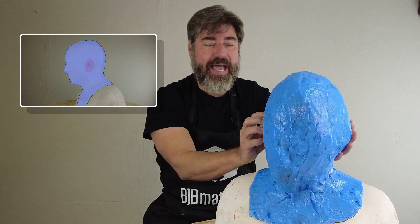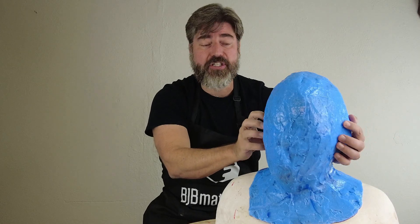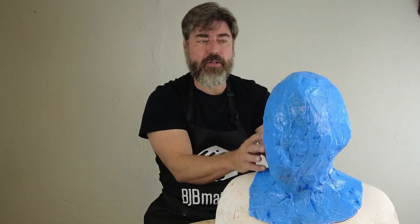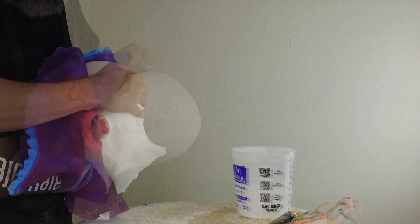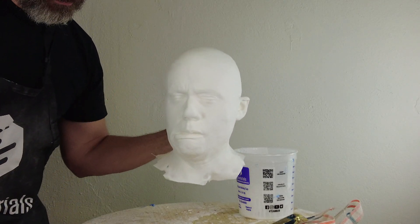The reason for the soft silicone around the ears is that ears have really complicated undercuts. You don't want too much drag or resistance on those ears or they'll snap and break when you demold. This is especially important if you're dealing with a HydroCal positive, a wax positive, or if you're going to be casting those kinds of materials into the finished mold. That soft silicone gives us the ability to demold the original positive without risk of breaking it, and also allows casting of more fragile materials with a much lower risk of breakage.